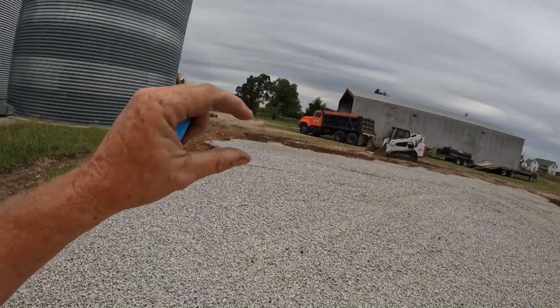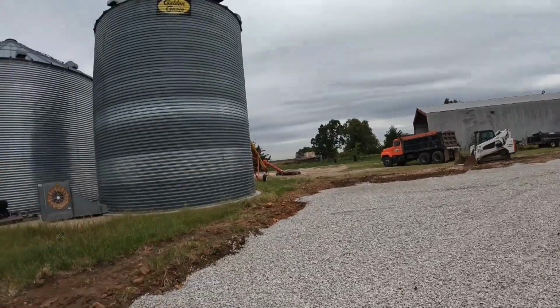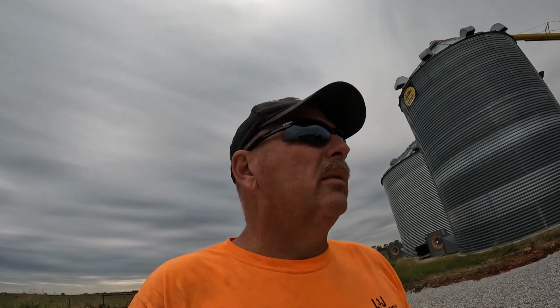I've got to get a bucket. I've been bidding on some buckets online, but I've got to get one because otherwise I'm going to have to cut the weld-on cutting edge off and put a new cutting edge on it, and I do have that bolt-on. But because the front of that cutting edge is worn, it's curved up, and the minute you try to bring it down just a little bit to grade, it digs right in because it's at such a sharp angle. So definitely got to get a bucket, and I think a new bucket would help considerably, or repairing that one. The bucket's not in bad shape, it just needs a new weld-on cutting edge and then a bolt-on put on it.